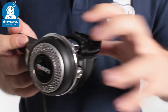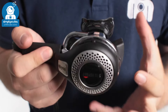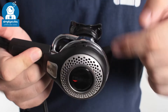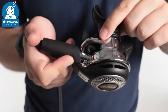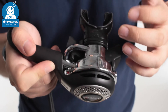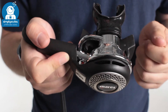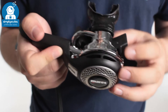The Abyss doesn't have any adjustable venturi or adjustable breathing because it doesn't need it. It has a bypass tube — instead of the gas flow coming straight into the second stage and muddling around before reaching the mouthpiece, it goes through this bypass tube which acts as a heat sink to warm the air up from the water, and controls the direction of airflow so you get a really smooth breeze. You won't get that same stuttering, so you don't need a venturi lever. It's a great design.